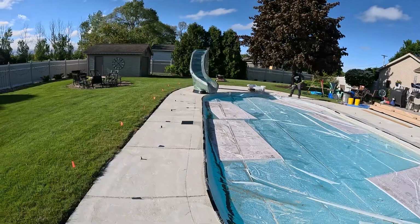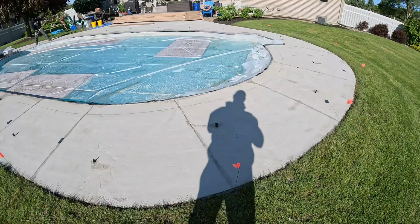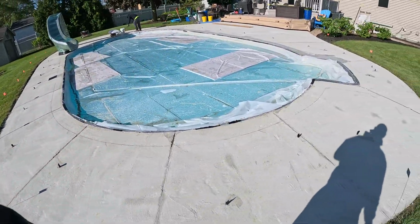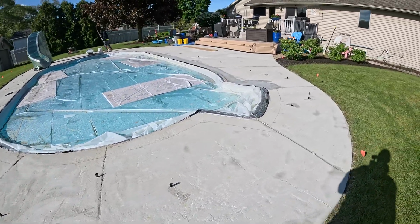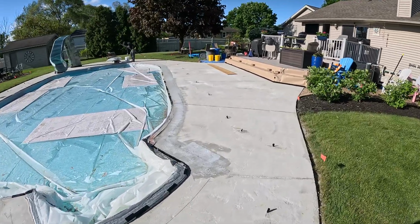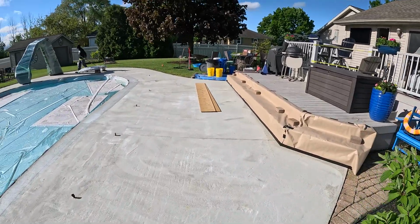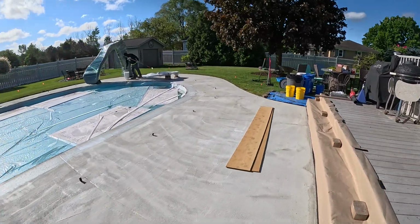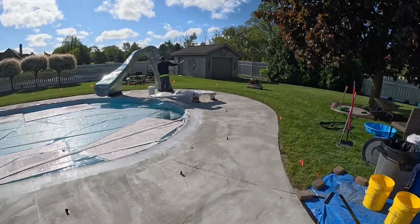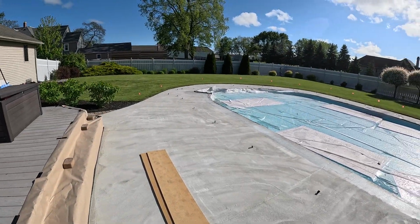So the plan is we're gonna spray the border, and these joints I usually cut out, but I'm leaving them half full right now, because I'm going to come back with a soft cut saw when we're all done, and cut into them, and anything that comes out. Anything that doesn't, we're going to use probably a nice lighter dark gray caulk on it and fill all those in, because you have to honor your expansion joint so it can still move, especially with the winters we get here. So the primer we're using is a flex primer. It's designed for cold weather environments where we have frost and things like that.